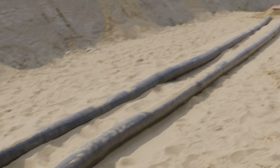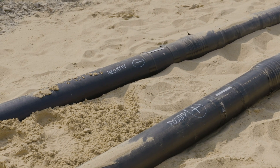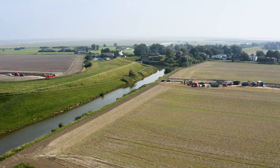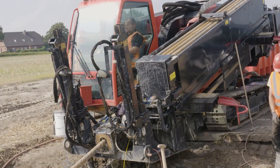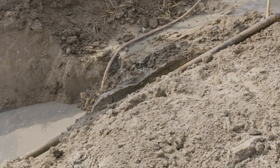The joints are then laid in the sand bed of the cable trench, along with the cable itself. Open cable trenches will not be used at places where the Nordlink crosses roads, railways, rivers, deeper ditches, gas lines or similar infrastructure. In these cases, Horizontal Directional Drilling — HDD for short — is used.